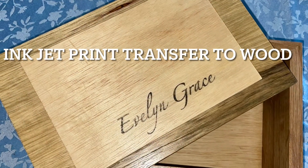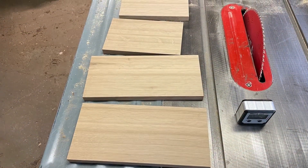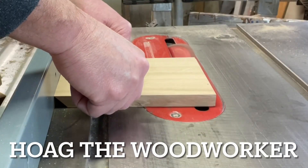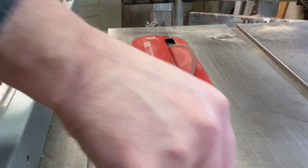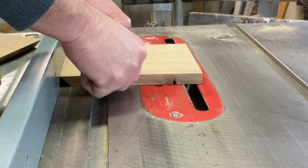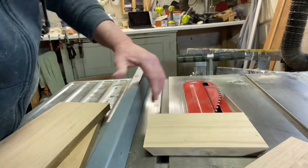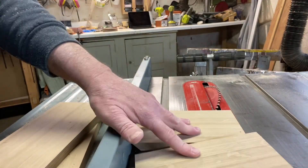This is my favorite way to make a box — just start with four pieces of wood where two are long and two are short. No dimensions, I didn't measure anything; they're just all the exact same size. Here I'm making the miters, but I'm not going to be happy with this test, which means I need to move the fence over just a little bit. I wasn't happy with my test fit, so I moved the fence over just a little bit.